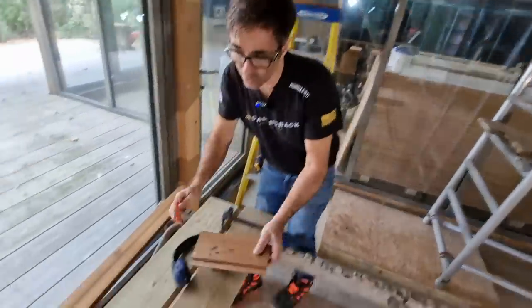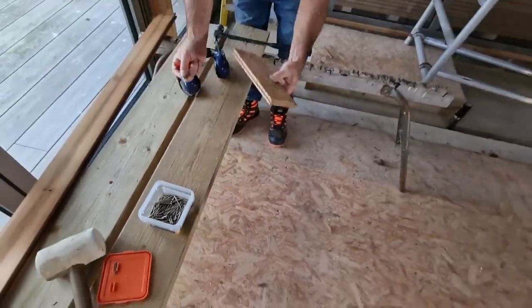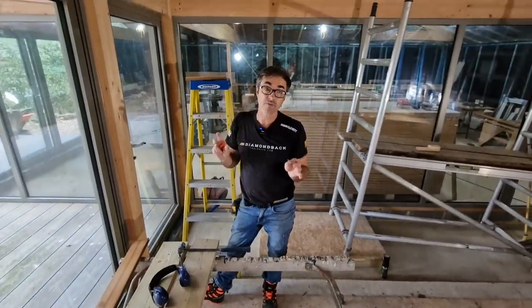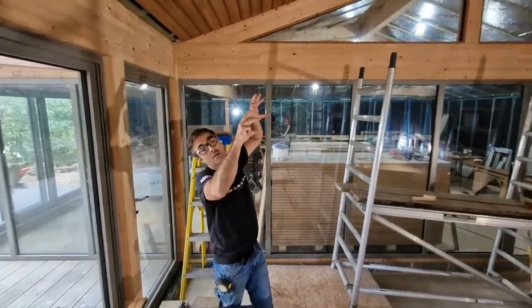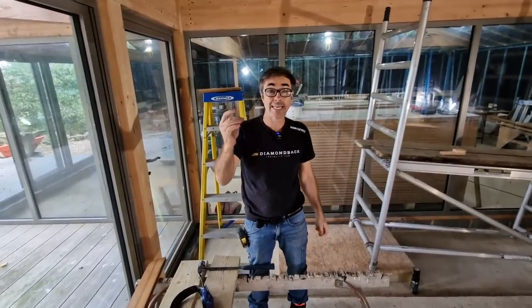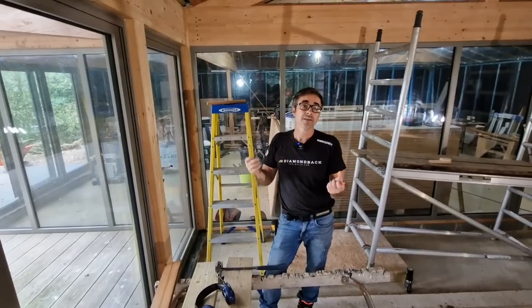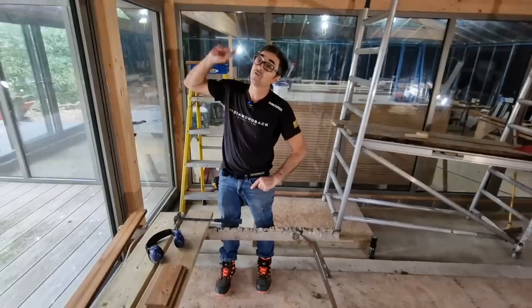Now this bottom one and the next one up, we've just got on trim screws, okay? We've got some tongue and groove screws. These are the tongue and groove screws. They're super small. And we are screwing this on the course above through the back of the groove, so they're hidden. Now, they can be fixed properly, but we've got three IP rated electrical lights coming in here, which basically shine back up at the roof slope. So until we've got the light fittings here, they may have drivers or whatever, and we may always have to have them accessible, in which case we will only use one of these tiny headed tongue groove flooring screws to attach those bottom two courses. So they're always able to come off should an electrician need to get into them. So that's it, we'll rip this down next and we'll fit this last one.